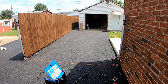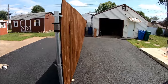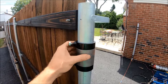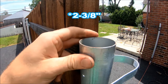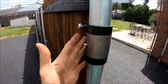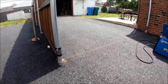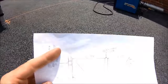Here we are at Tyler's — this is where he wants to put in the two-piece gate. Just got done putting this fencing in over here using steel posts, and that came out pretty nice. Going to be doing the same style collar hinges as on mine, but he's using two-and-seven-eighths posts instead of four-inch. He was able to find these as a set online instead of fabricating them — pretty nice. We just set a string line across the bottom, it's fairly even, and that's going to be our lower picket line.